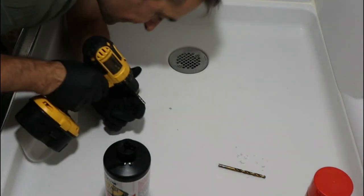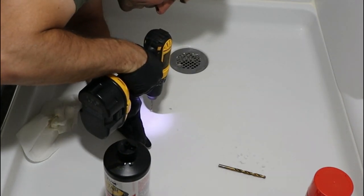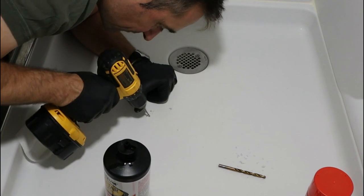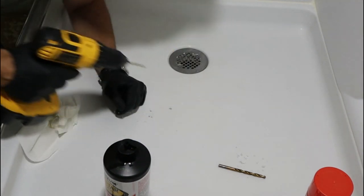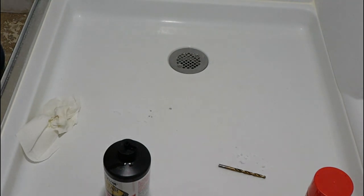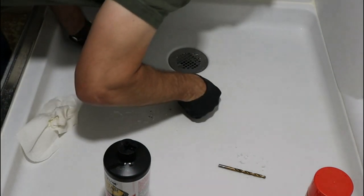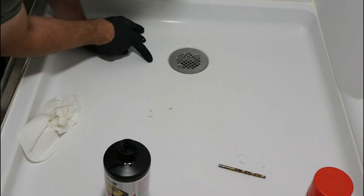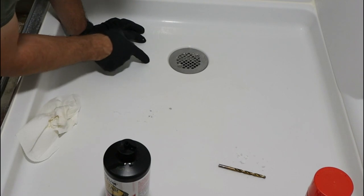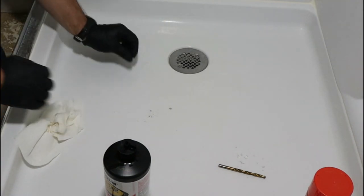So there are a couple other little veins of the cracks, one here, and then, oh yeah, there's actually already more than one, so one here, and then another one. That will also give us a little bit of control, so we can see the foam coming out. Here, these superficial cracks, I'm just gonna leave them alone. I'm gonna sand out this nick that I created to fill it with epoxy as well. All right, so vacuum cleaner is the next step.